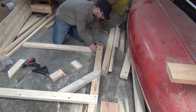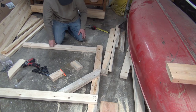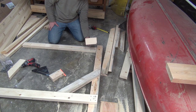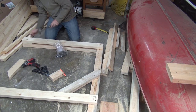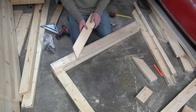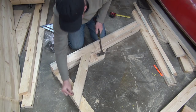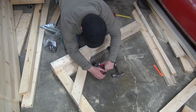The final part of the base is two 2x4s that are 4 feet long, going right at the bottom. We're going to use the leftover blocking cut from the verticals — we cut them down from 8 feet to 7 and a half feet, so we'll place this at the other end so that when we put the other one on top it will be a firmer and stronger base. We'll take one of our brackets and attach it at the bottom to make sure we've got that extra strength and the canoes don't fall over with all that weight.